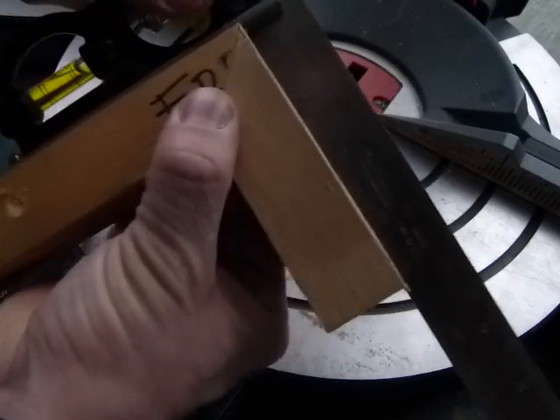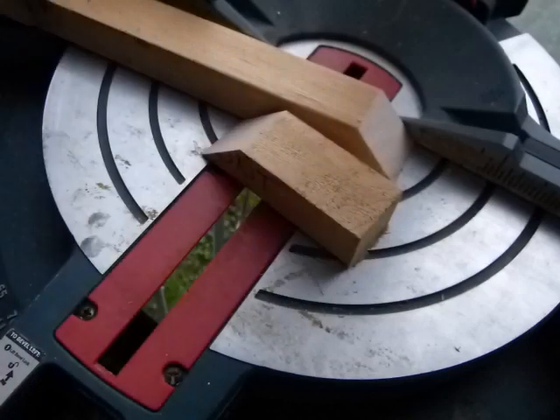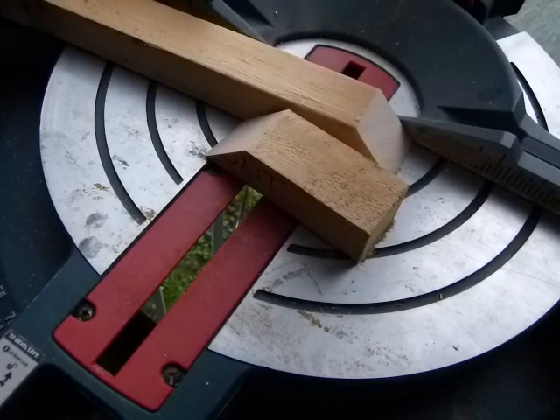You can see that this corner is a 90-degree corner. That's how you can check your bevels and your bevel stops on your compound miter saw. I do recommend that you don't start cutting with the compound miter where a miter angle might mess up your measurements. Instead, just do a square cut, do a left 45, do a right 45, and test one thing at a time. That's how you do it.